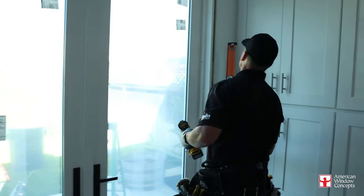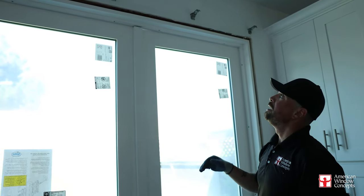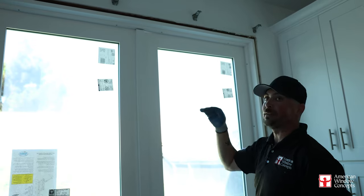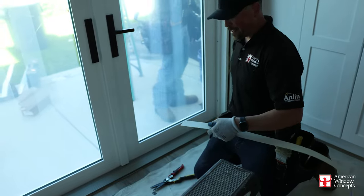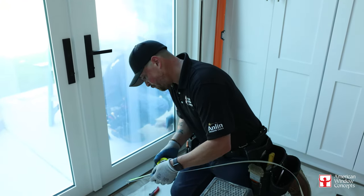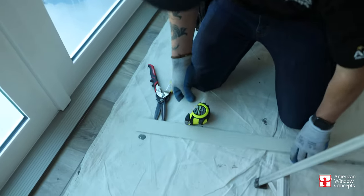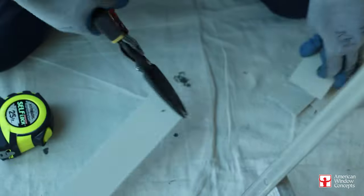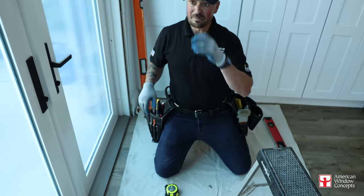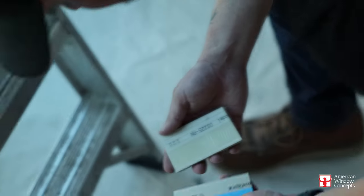No gaps. Bubble in the center. Now for the top, I'm going to use a smaller level because I don't want this thing to crown on you as you're screwing it in. I might put a stack of shims at the top — about four inches wide. This is tan window trim, and what I'm going to do is make a stack of these. They stick together, they're easy to use, and they don't break down like wood does. These doors are relatively easy as long as you mind your level — heavy, very heavy doors, but easy to install.